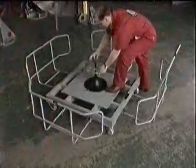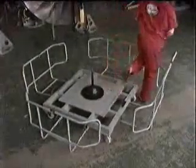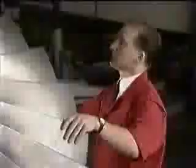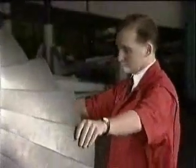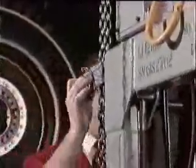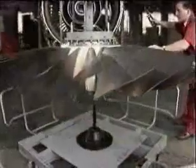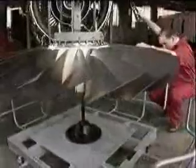Remove the wing nut and clamp plate. The fan module must be rotated to the horizontal position using 2 hoists. Note the use of the quick release pin, which provides additional stability. The fan is then lowered onto the storage stand.